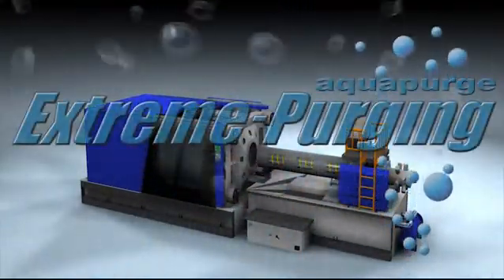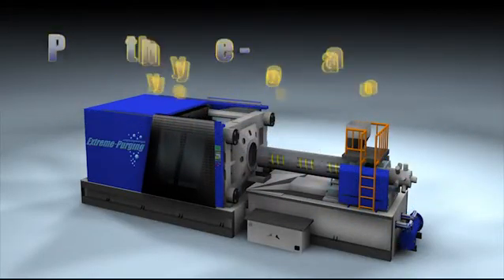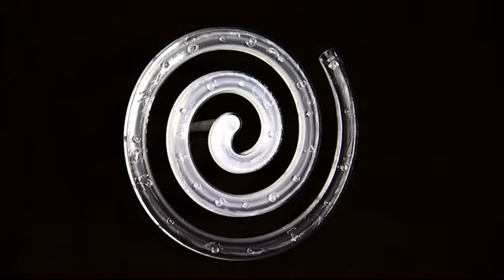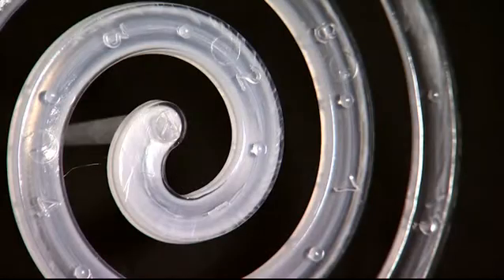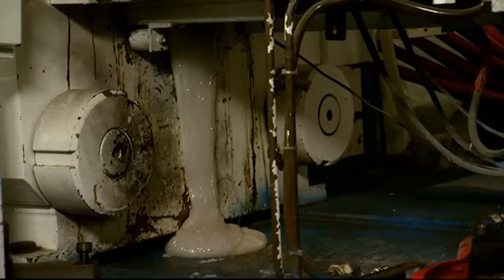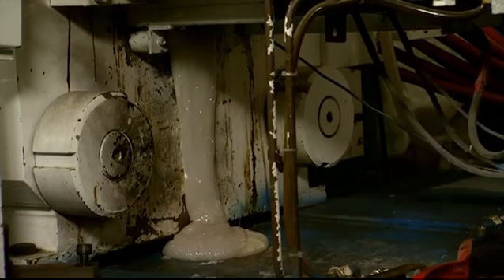Here's a common one. You've finished moulding polyethylene and you want to switch to polycarbonate. Pretty easy, you say. But here's what can happen — the dreaded milky mouldings. Cloudy and opaque. That's no good for riot shields or medical mouldings. Well, that's easily avoided. Once you've put through all your PE, run it out, run through a few kilos of Barrel Blitz Universal.